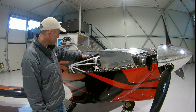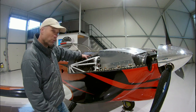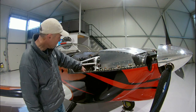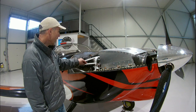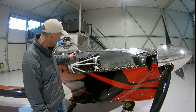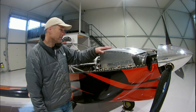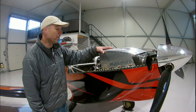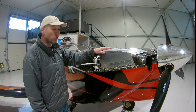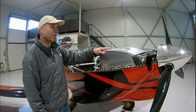There are two ignition coils. Every cylinder has two spark plugs, and every spark plug of each cylinder is on a different coil. There are also two batteries in here. There is a brake fluid reservoir with a special cap so that during sustained inverted flight you won't lose all your brake fluid. It's a six-cylinder engine — a really nice engine that produces 200 horsepower, which is way enough for this machine. I think the turbo version is now also available producing around 230 horsepower, but that would be ludicrous for this type of airplane.